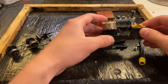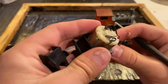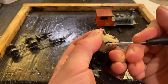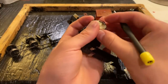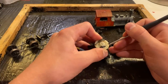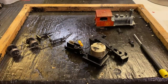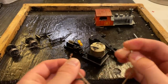There's all of that. Having a look over the motor here — this tab is okay, but if we come over here, you can see one of those has actually been pushed under. I'm really hoping there are no problems with the brushes. I'm going to try to get that back out of there, and then we're going to try applying some power to the motor. I'm pretty certain there's going to be a problem with those brushes, just based on what we've seen. I think somebody might have tried to open this up at some point. Let's try giving it some power — I've got some live leads right here.